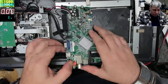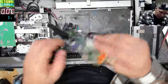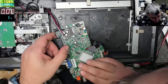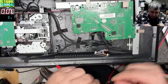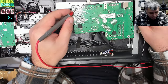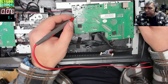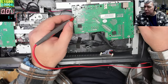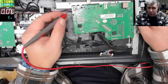Now, one problem before replacing the fuse. The question is why the fuse is burned. Yeah, so those are the fuse pins there. What I will do, I'll come with 12 volts after the fuse, yeah? Ground. So this is the input of the fuse here, and obviously it's nothing. And this is the output. Output of the fuse here. Output of the fuse short. And the short... it's not short anymore. Okay. That's sick. It was short, it's not anymore.